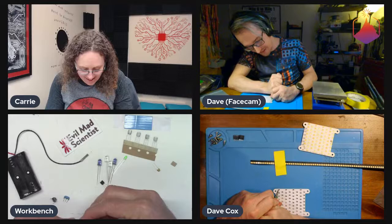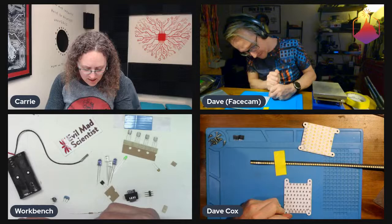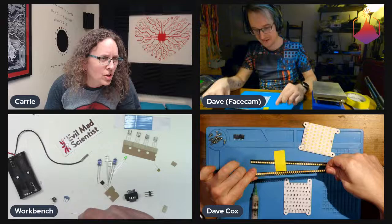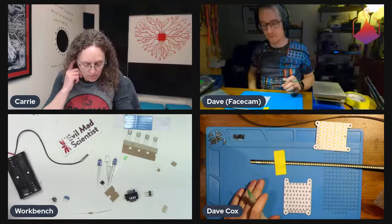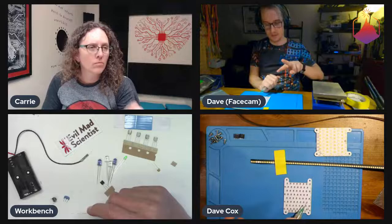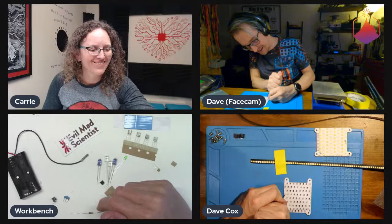So I'm going to manually apply solder to each pad. Normally I do this with a podcast and it's really chill. What size components are those? I don't actually know — these are LEDs. I don't know what the spec is. Are they addressable like WS? No, these are just two pins — a quarter of a watt at 3.2 volts each, and they're high CRI. I didn't want multiple colors, I really just wanted color temperature adjustment. So there's a cool one and a warm one, and you can adjust them both independently. Depending on the sunlight coming into my room, I can match it — that was basically the use case.